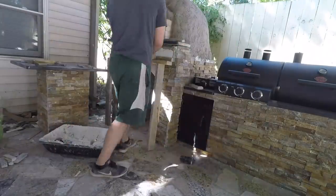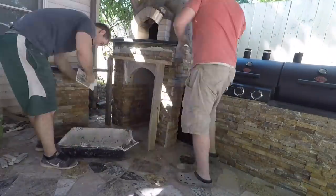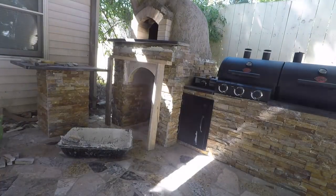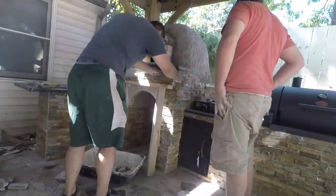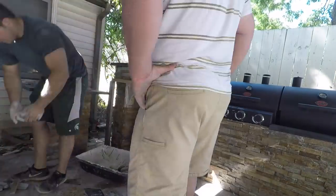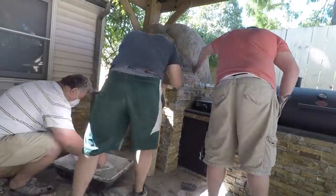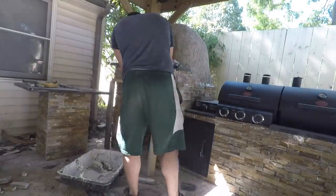I'm thin setting. I put some thin set down, then back buttered every piece and just slapped them in. So even though that's all flat pieces of tile, the curve looks really nice just below the granite piece right there. So I'm just tiling in piece by piece.